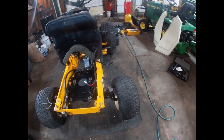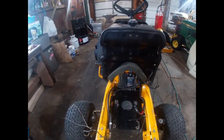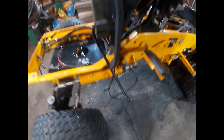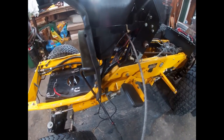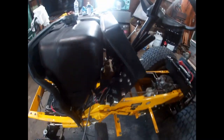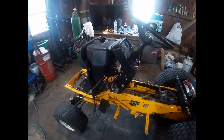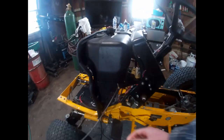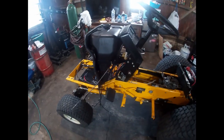I've just kind of been going over the tractor with a fine-tooth comb, really addressing anything that looks a little concerning. I still have to replace the fuel lines — I mean, they don't look bad, but God knows what kind of fuel this thing's had run in it over the course of its life. It's always a good precautionary step to clean the fuel system out and replace the fuel lines, since rubber fuel lines get hard after so many years.